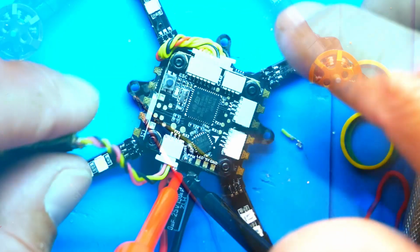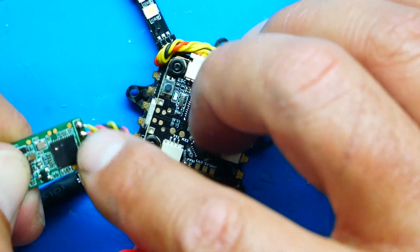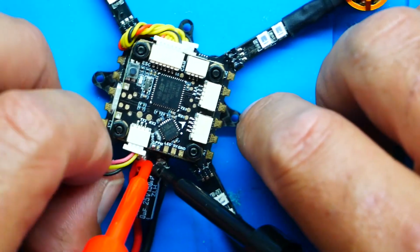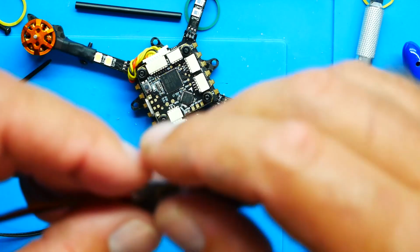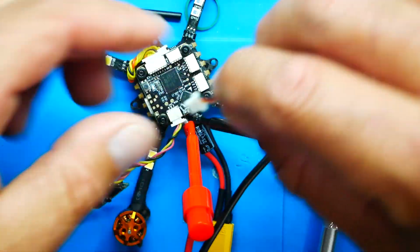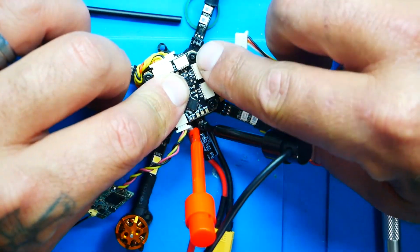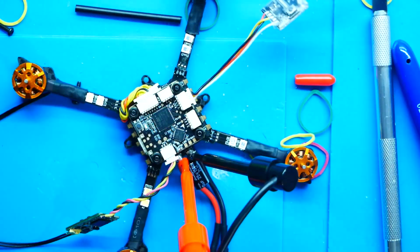You can use that. All right, so what I did is I soldered up my ground, positive, and S-Bus, and then I stuck the pins inside of the connector, and I plugged it in, and then I twisted the wire up. We can probably leave it connected, and we can take our VTX connector, and we'll plug this guy in. It does say VTX right there, so you don't have to hunt around for this one like you do with the receiver. I'll plug in my VTX.